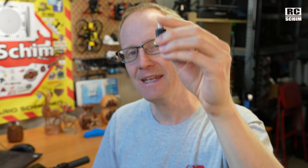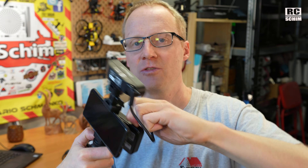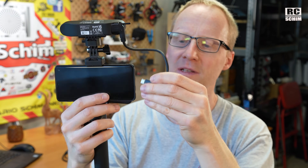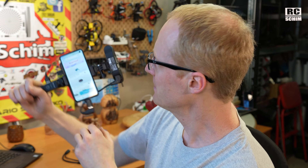There's a wire cable and a little USB-A to USB-C adapter — and that's very important. That's the only way I got the USB-C connection to work directly with my phone. Not the long cable, not another USB-C cable — just this cable with this adapter plugged in directly into the phone. I had to turn the adapter around, so try both ways. And then the app started.